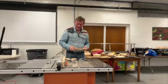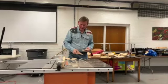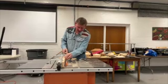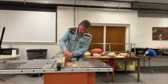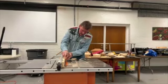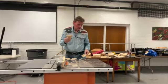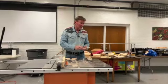I can't demo it here because I didn't cut the top, so I don't have the mating angle for it. I have the mating angle if we had a right tilt table saw, but you get the idea. Don't try to push it through like this. Not a good idea. You want this piece behind it with a mating angle. Pass it halfway through and then just back it right back out. That gives you your top. You take the measurement the exact same way.